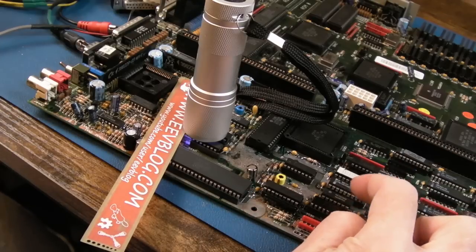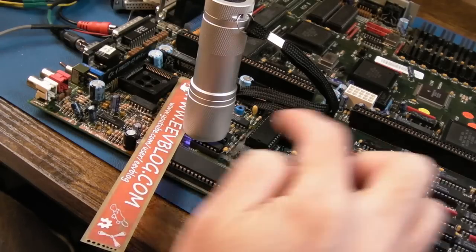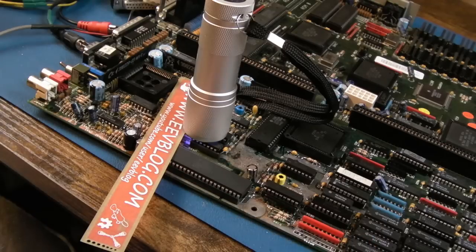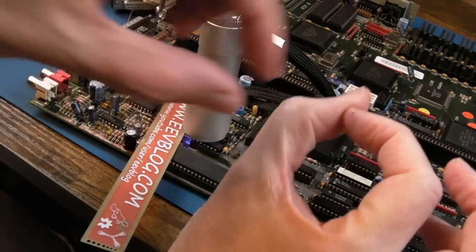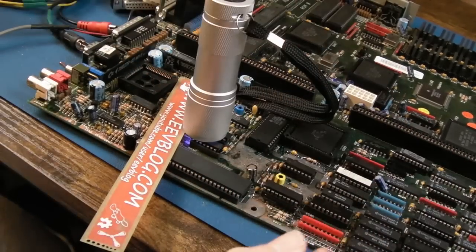That would be a good candidate. If I'd had a turn pin socket that size, I would have fitted one there and there and there and there, because when they've got short pins, they fit really well. Now, I've had lots of people saying turn pins are awful because the chips don't make a very good connection because of the round socket and a square pin going in. It just presses on the corners, and that's kind of true.